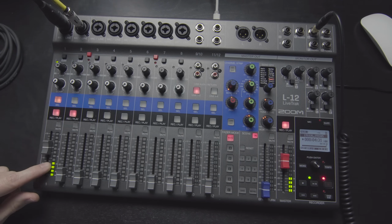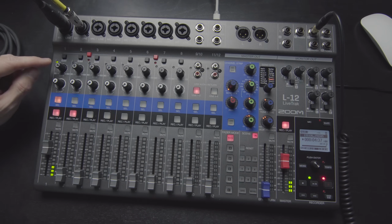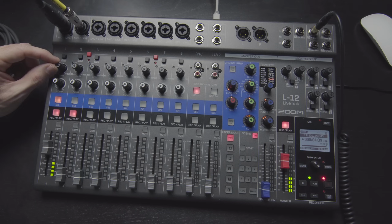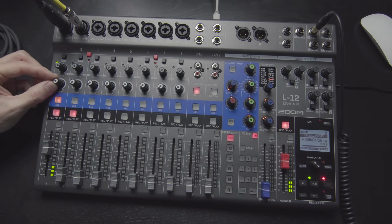And I'm not quite getting the levels I want exactly through this microphone, so I'd have to come up to more like about 80%, so I'm around that -18 mark. For digital, that's going to be good for me. And you can hear that that is clean as well. But as you bring the compressor up, you can hear that it increases the gain as well